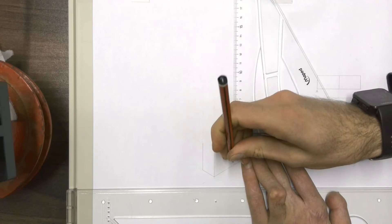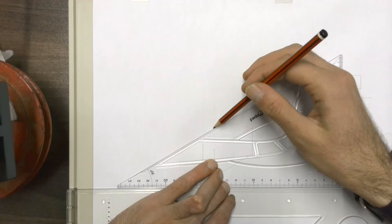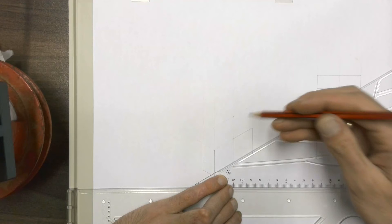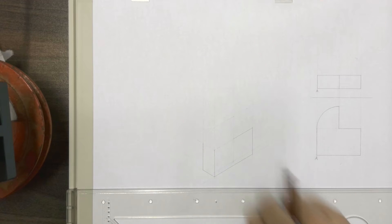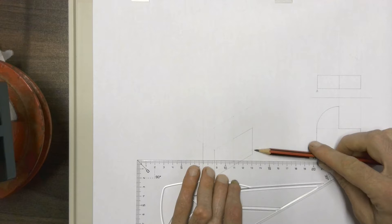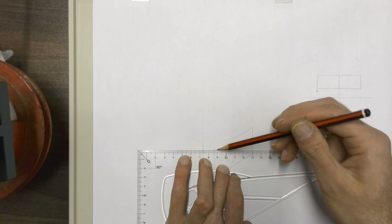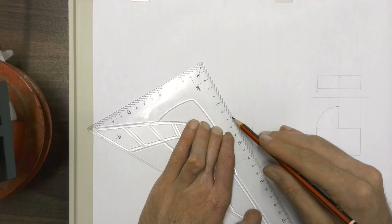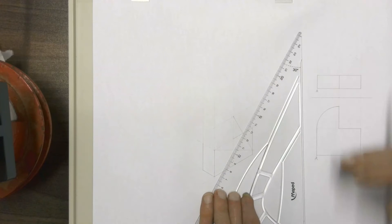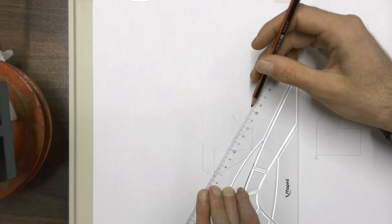There's my 25mm up, and there's my 25mm down. Then I'm going to draw two construction lines — one through the line at the top and one through the line at the bottom. And there we have our square that we're going to use for our isometric construction. We're going to go from the one obtuse corner of our square to an opposite center point and draw a line, then again from the same obtuse corner to the opposite center point and draw a line, and we're also going to join our two acute corners with a line.